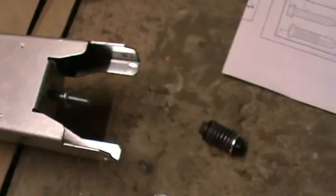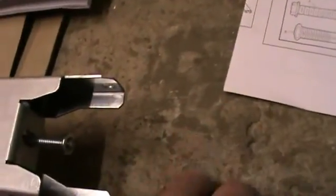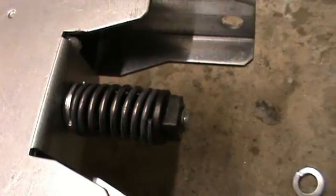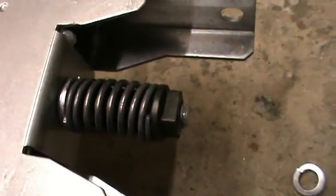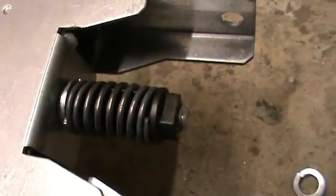This is the end which goes nearest to the door, and here's the coach bolt fastened on earlier. Now fitting the spring bolt: screw on the spring tension nut finger-tight. Set a screwdriver into the slot and tighten the bolt end until the washer at the end of the spring jumps against the header plate. I had to use a pair of round-nose pliers instead of a screwdriver, but it eventually jumped in. That is now the correct tension on the chain.